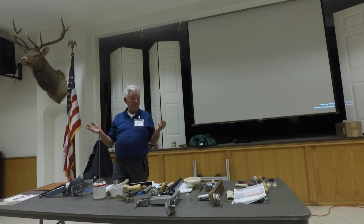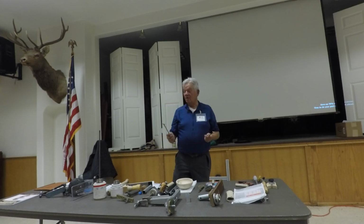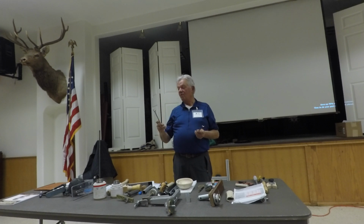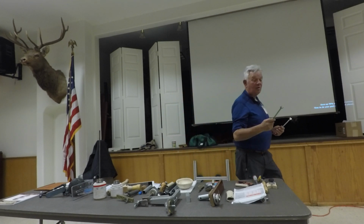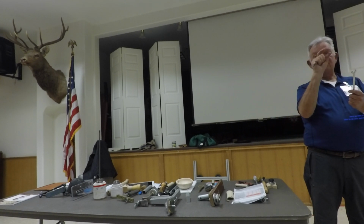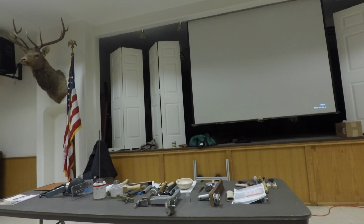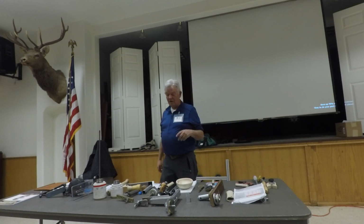Anybody who has an idea, I laid this out. Since I've done quite a bit of spindle work, what does that look like? They're spindle cutters. You want to make sure when you go to the tool swaps that you get a really long wrench. When you're doing furniture spindles, they'll have little different nipples on the end that fit into the chair. These have all been sharpened, and they make an excellent cutting tool for knocking down your diameters. I've got a bunch of those.